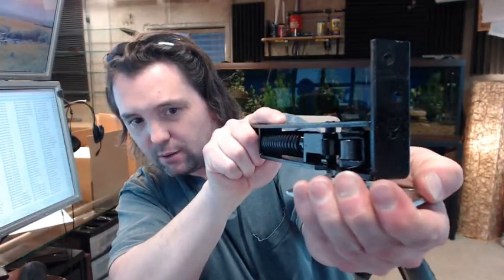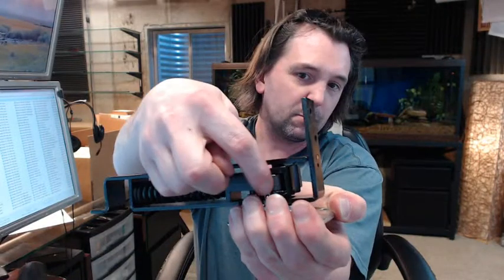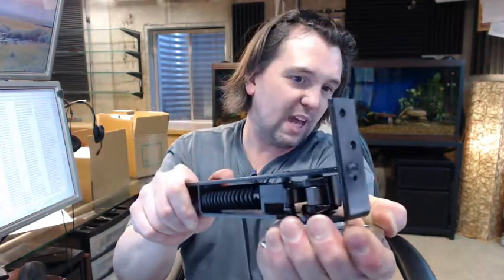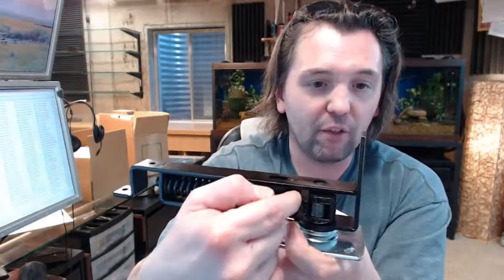So as the door goes through its cycle of opening and closing, as I try to twist that back there, you can kind of see that there's a, really can't see it. You can see that there's a, on the inside of this hub, pardon me, this part right here, I'm going to open it, and as you see, there's a, well, you can't really see it, but there's a bird's mouth sort of preparation. If you were to push that open far enough, and I can't do it with my hand, it's just too strong of a spring to do that, that bird's mouth here is going to rest over these rollers, and that's what is going to allow it to hold open at roughly an 85 or 90 degree opening.